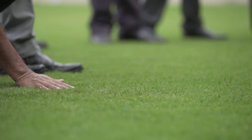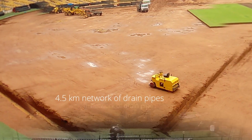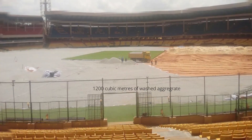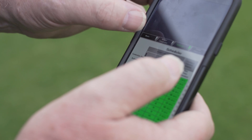For the SubAir system to function at its most efficient best, it needs a compatible base. The old base, which was laid about 40 years ago, had to be removed, so we excavated the soil across almost 13,000 square meters. We laid a pipeline system of almost four and a half kilometers in length. All these pipes are in a closed loop system and converge at the air-water separator, which connects to the SubAir system located under the stands. There are 12 sensors around the field measuring salinity and moisture, plus two oxygen sensors. The system can also be accessed via phone.